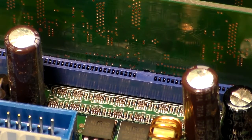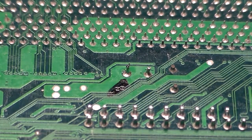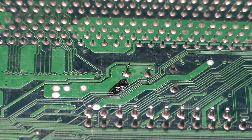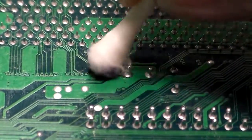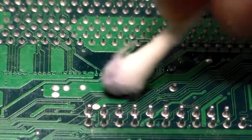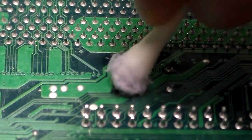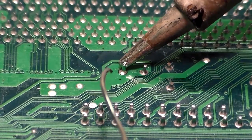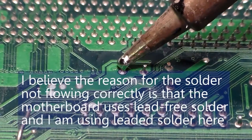On the bottom of the motherboard I went ahead and marked all the places where the capacitors are that we need to remove — just a little black Sharpie mark beside the two solder points for each one. I want to get a good soldering surface here and clean away any garbage or oxidation off these pins so we can get a good heat transfer. The pins are kind of small but I believe we can do it. I'm going to try to add some solder to these first to beef them up so I can use my soldering plunger.